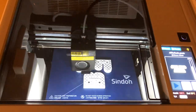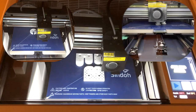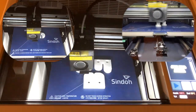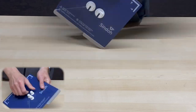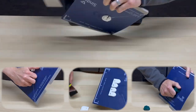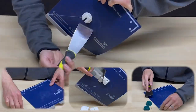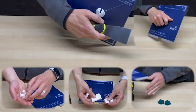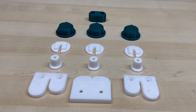To make all of the locking mechanism parts, as well as all the monster-themed accessories, we fired off a few small 3D print jobs. They completed fairly quickly, and for the most part were easy to remove from the print bed by hand or with a simple swipe of the putty knife. I always seem to have one print, though, that puts up a fight. I really have to remember that when a part's design allows for it, I should add a small chamfer to the underside. This will make it much easier to get the putty knife underneath the piece.